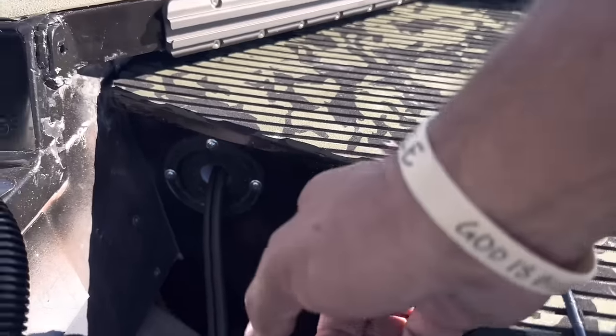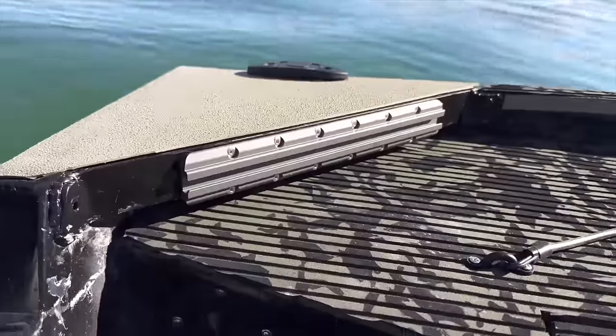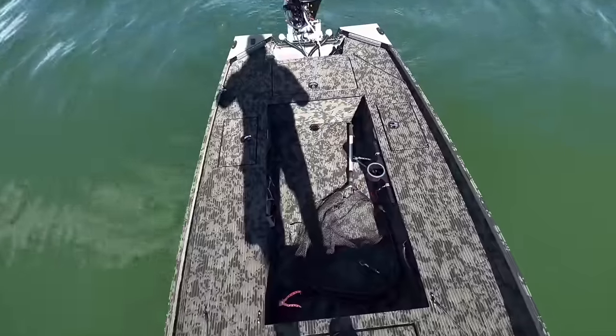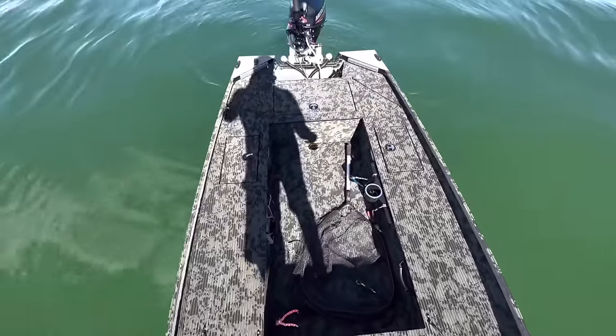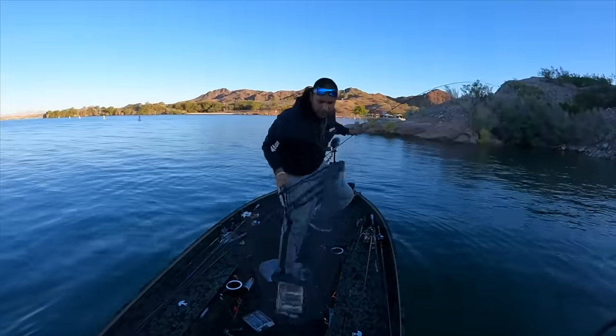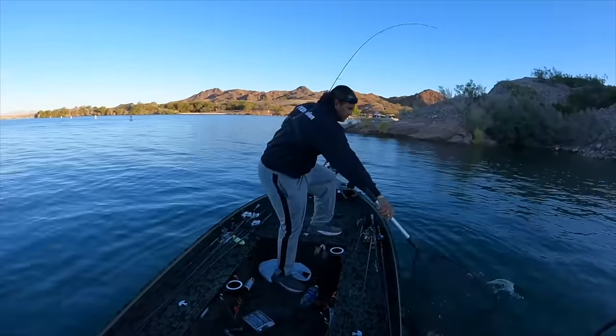And also I offset that bottom. I never really show that to anybody, but you see that water floating underneath the back channel? Now, if the back pod connects all the way to the bottom of the hull, that's where the pour foam is at biggest risk of getting saturated. So we offset that a few inches off the actual bottom just for that. But that's all fine and dandy. I just demoed the boat on clear water on the best blue sky day.